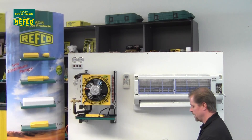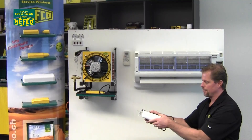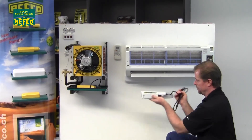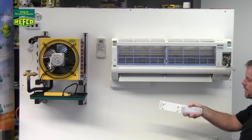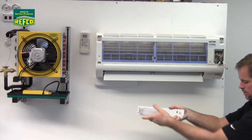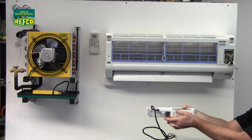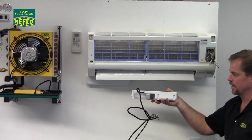This particular one right here is already mounted on the right-hand side of the fan coil. One of the nice things about these pumps is you can install them either way. So you take off the cover, and if we wanted to mount this on the other side, what we can do is take the pump off the back plate, move the water tray over to the other side, take the pump, turn it around, and it mounts on the back plate this way. So it's easily installed on the right or the left underneath the fan coil.